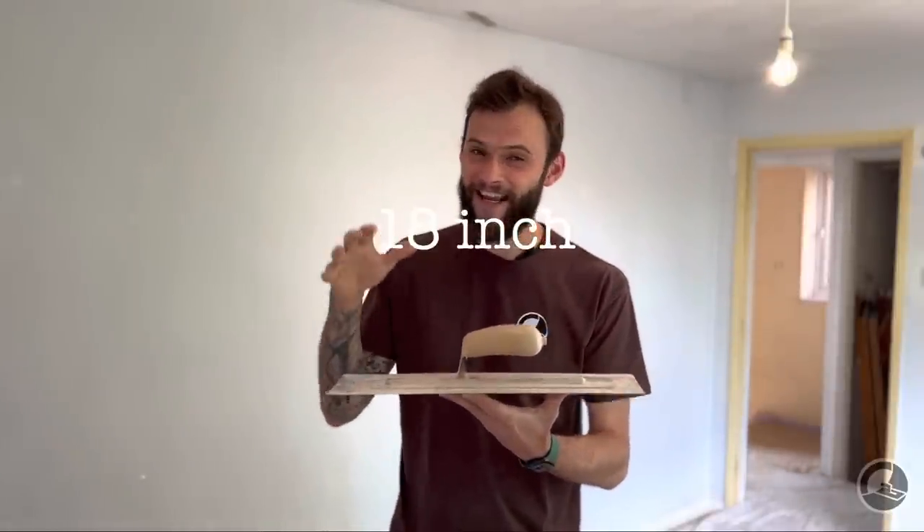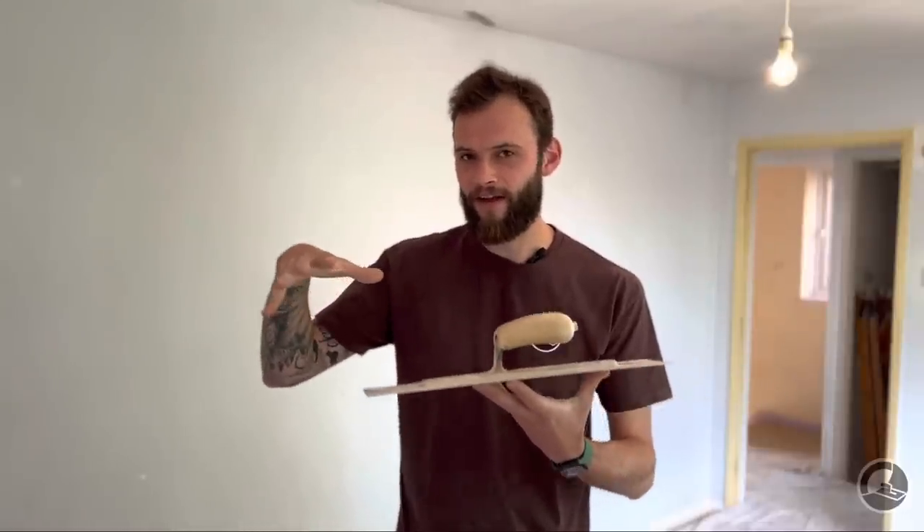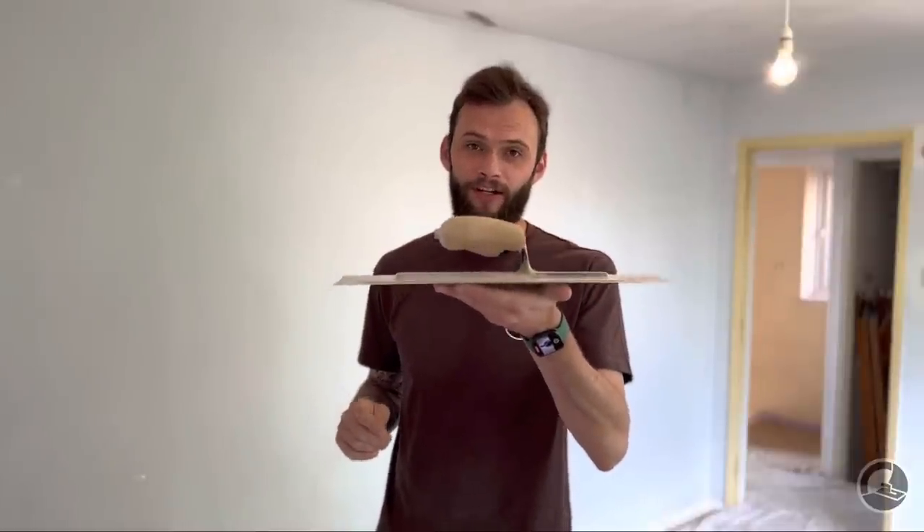This is an 18-inch Nella Midi — their slightly stiffer flexible trowel. For those that watch our channel, you'll know we did a video some time ago — I'll link it on screen — where we discussed which is the best plastering trowel size. We encouraged not using trowels over 14 inches because you get fade on the edges; as soon as you go over 14 inches you can't get even pressure across it. So I thought it'd be worth a go to see just how good a finish I can get using this absolute monster of a trowel.